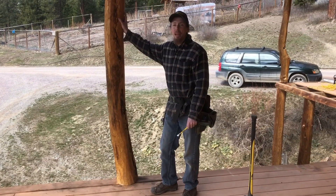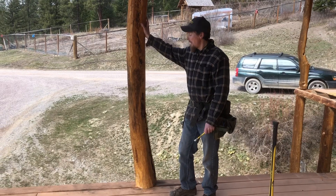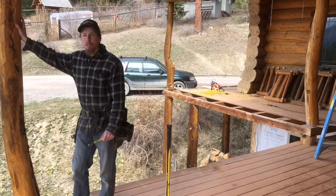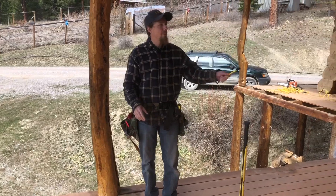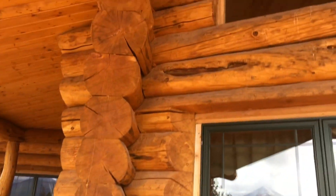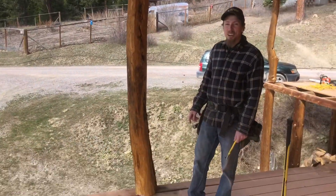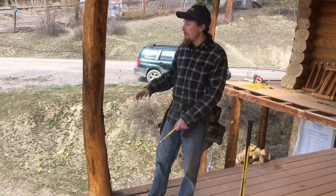We started a major project here at our Montana Haven homestead. We took out all the railings as you can see around here — some of them were getting pretty old. What we're getting ready to do is completely refinish this whole house. We're going to media blast it with glass beads, get all the old stain off, then we're going to stain it and chink it. These wonderful, artistic, crooked posts — I think it's time to move on to something more modern and straight, so we're going to rip these out of here.